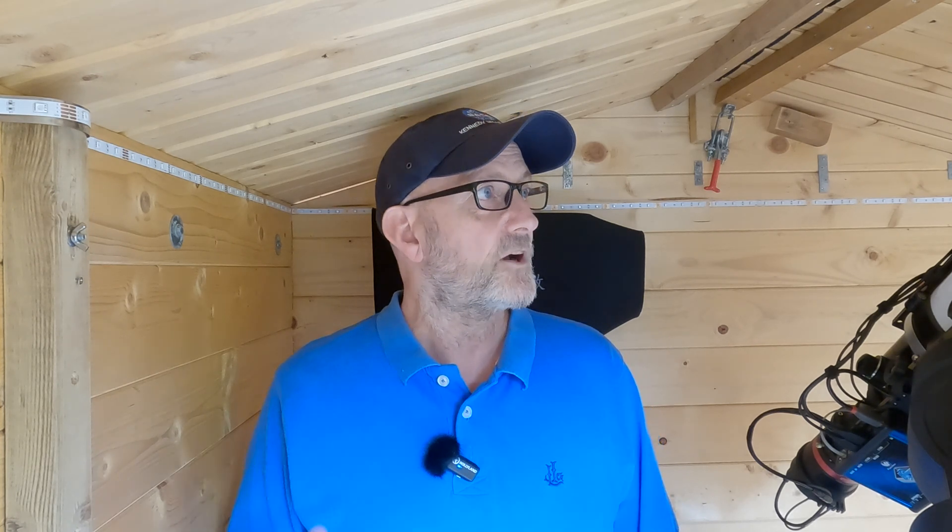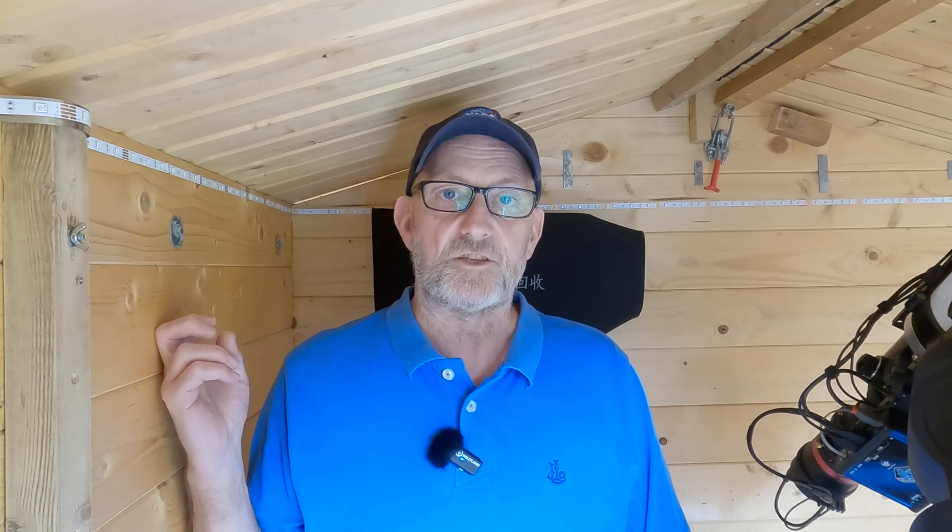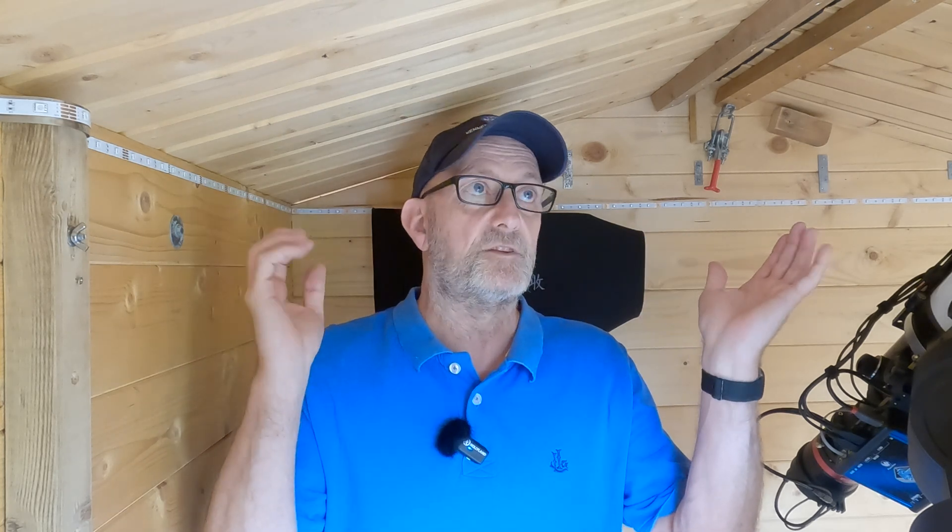I'm going to give you a few tips that I've used in my particular shed — my astro shed — of how I've combated condensation and had no problems at all. I'm not saying this is the only way, but I found this works well for me so it may work well for you too. I've got a shed here which is an off-the-shelf shed, just a few hundred pounds, converted — it's just tongue and groove 19mm single skin. I converted the roof to open outwards; it's not a roll-off roof.